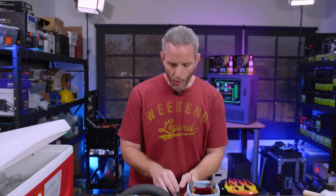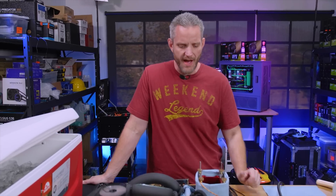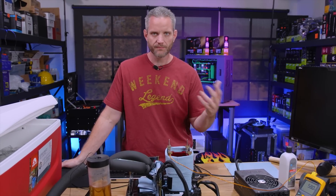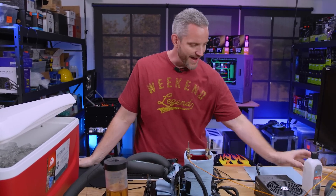Here's our setup — we've got one GPU because I'm really focusing on single GPU today. We heated up the pot, and the reason we did that is I observed Vince do it with a torch. Because you're going sub-zero, you don't want the thermal paste to harden before it spreads. As you heat thermal paste it tends to thin out and spread more between the materials it's touching. So if we went straight to sub-zero it would never spread. We heated it to about 60°C — we're at 58.1°C right here.